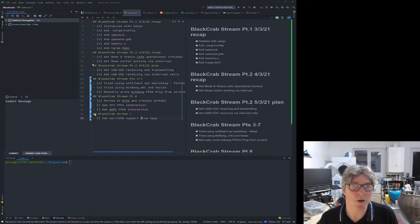Then once we get that working, we can then move that over to the quad SPI link in SPI mode, is what I'm thinking. We then have some RTL that we know works, and that just enables us to get that working on QSPI, and then we can work on taking that up to dual SPI, etc. Because it's a new library.